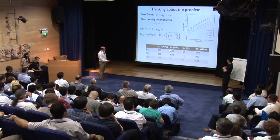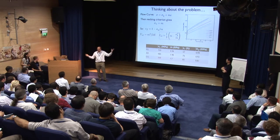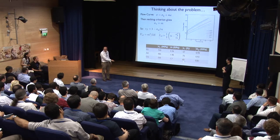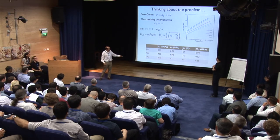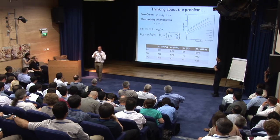So simplistically, I'm changing the hardening rate a little bit here, but I'm changing the yield strength more. So what I'm doing is, if I take those two things and calculate a ductility, the ductilities I'm measuring are a bit different, but then my test isn't very well aligned and it's a thin sample. I actually believe these more. This is a ductility just from considering necking. So if you make it finer grained and you increase the strength, you do change the hardening rate a bit and that will give you a drop in ductility. So I'm making a sort of a simple argument.